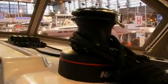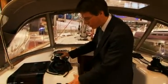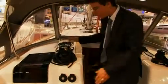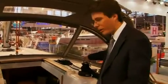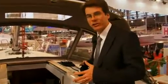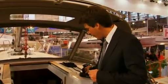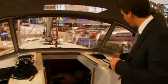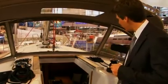Up on the coach roof of the boat we've brought a lot of the functions back. On the port side we have a winch that can be equipped with an electric function — a nice feature for using all of the halyards for the boat, with all controls for the halyards as well as the reef lines coming back here. Over to starboard we have another winch — a manual winch, and this is an optional winch. Because of the way that we lead back all of the sheets to the helm, this winch is not necessary unless you're using the boat with a lot of spinnaker gear. If you do not order this winch, a small pulley provided by Harken allows you to bring a line across to the other winch.